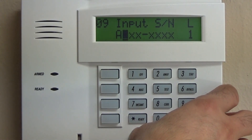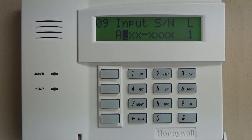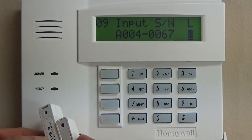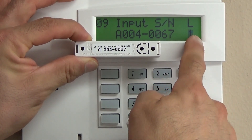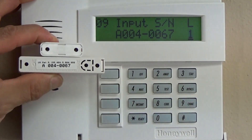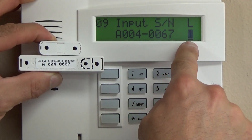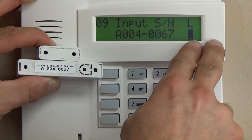There are a couple of different ways to enter the serial number. A serial number for a wireless transmitter is located on each device — on the outside and typically inside — and there are a couple different ways to enter that. What you just saw was: if you open and close the wireless zone while you're in that programming, it will automatically register the serial number, which will match the device and assign the correct loop number. This is the easiest way to properly program the number in there, because if you manually enter it and have a large number of zones, a common mistake is to mess up on the loop number if you're not exactly sure whether it should be one, two, three, or four — and those are different for different types of contacts.